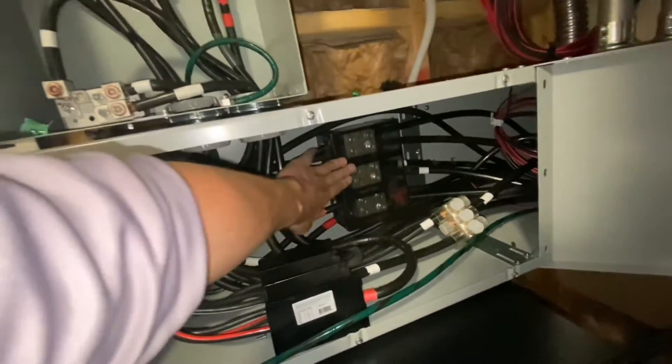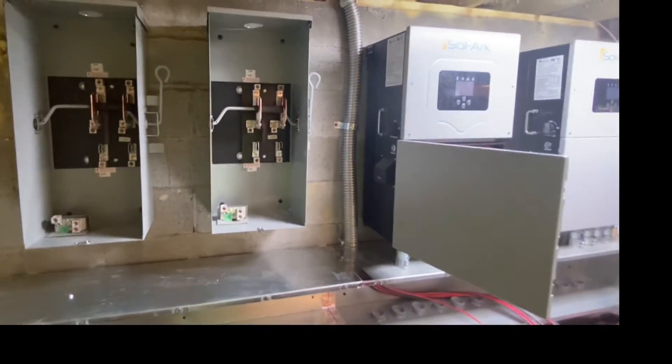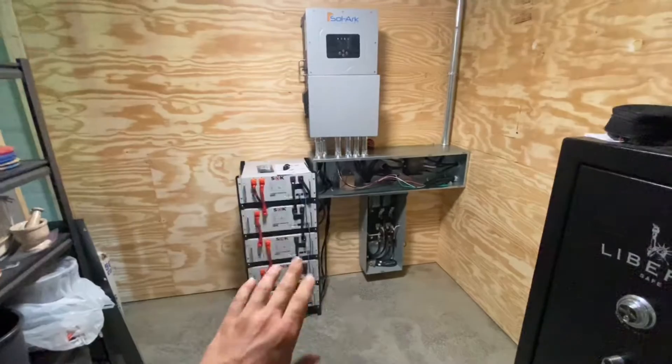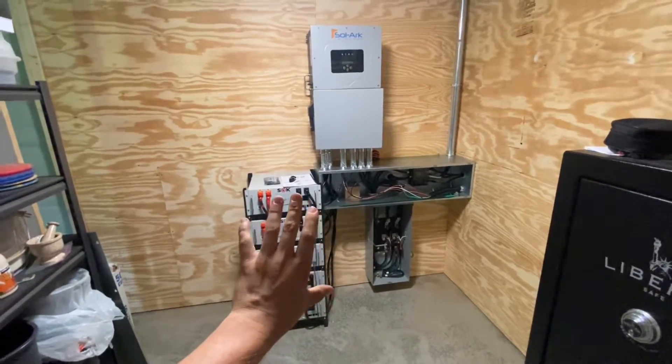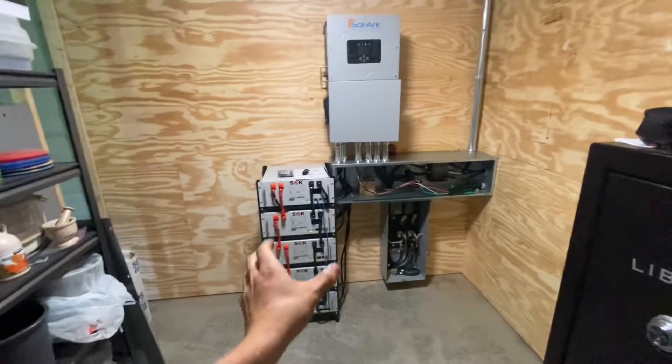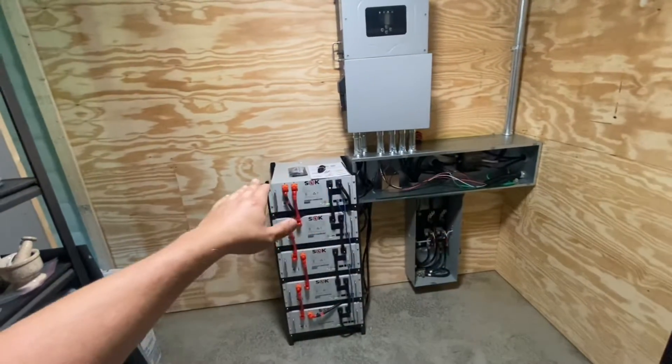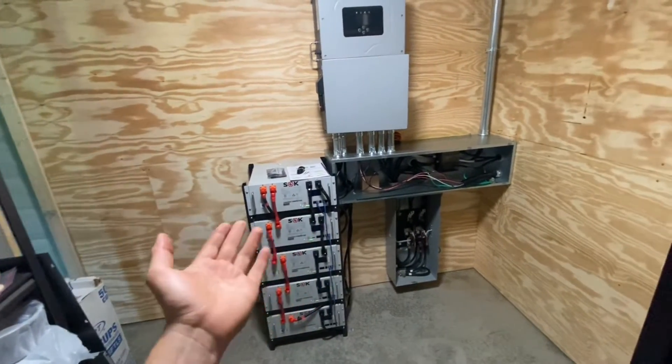Here's one where the guy had plenty of room — two 200-amp services passing through two four-foot wire ways, so that's plenty of room. Of course the battery is hard to avoid taking up some floor space, but you can always go vertical with your battery, so you could fit a dual-stack system in six feet.